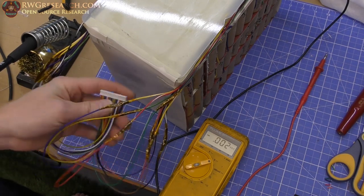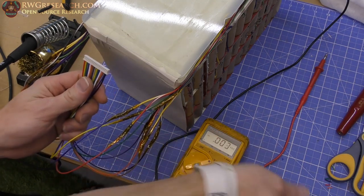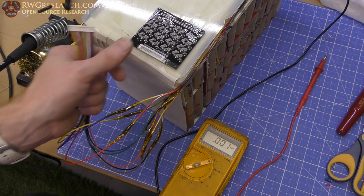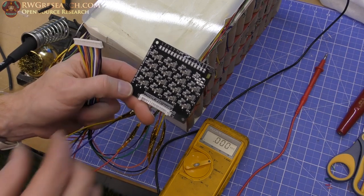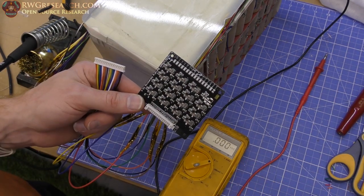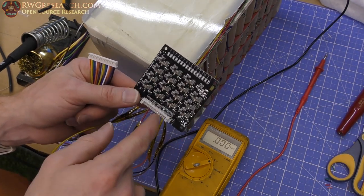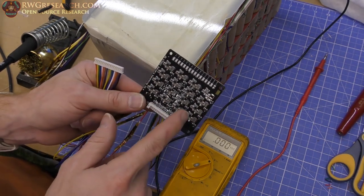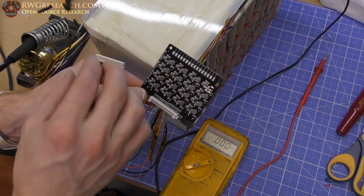So here's the deal. The BMS battery management system is complete. I'm about ready to basically plug this into the BMS board. That's an advanced board. It is a balancer board. That's all it does is balance the cells with each other. So all of the cells are equally balanced when this thing is finalized. And the important thing here is that this is not a heat-resistive wasting element balancer, but instead, this actually takes charge from one of the higher batteries and puts it into the lower batteries.